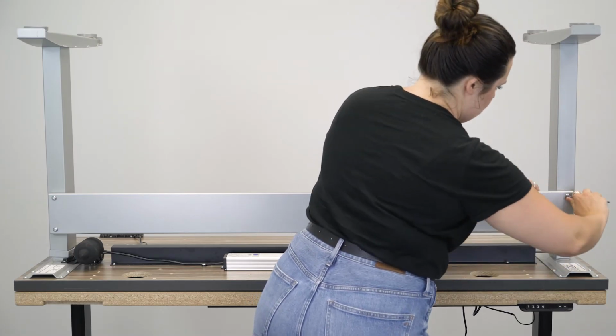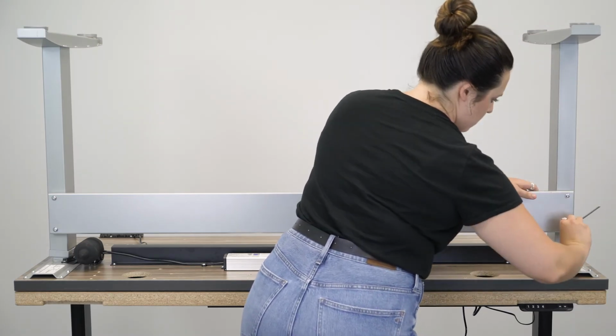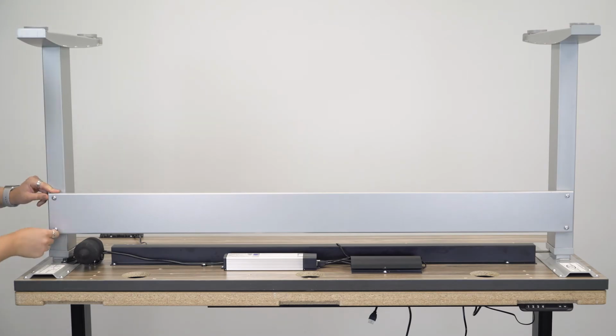Make sure to also pay special attention to your desk assembly instructions. Some may explicitly tell you when to keep a bolt loose or when to fully tighten it. Please take note that there is such a thing as over-tightening your fasteners. Tightening them too much will cause them to strip.